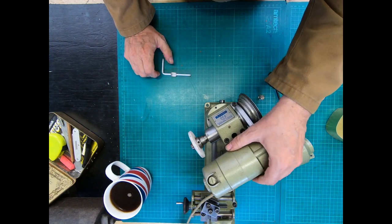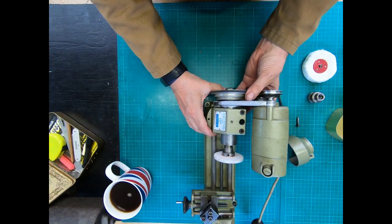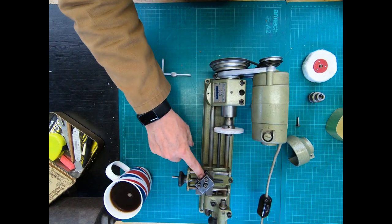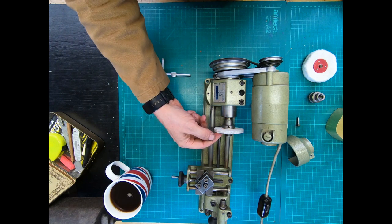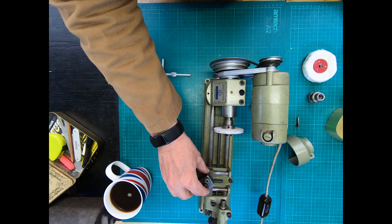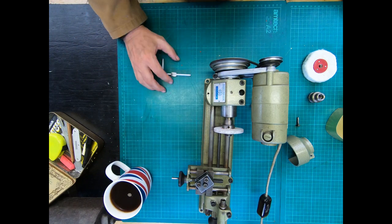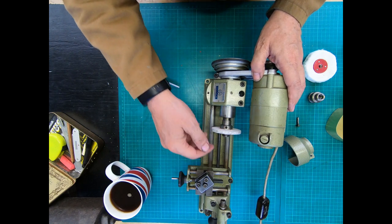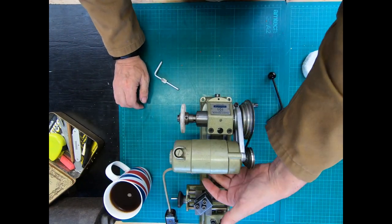You can have it facing this direction, then put a cutting tool in there at the angle you want and use the grinding wheel as a holder for your tool - quite useful. The only disadvantage is if you're trying to grind something by hand this way, the ways are not covered, and to be honest you're probably better to put something over them to protect them.